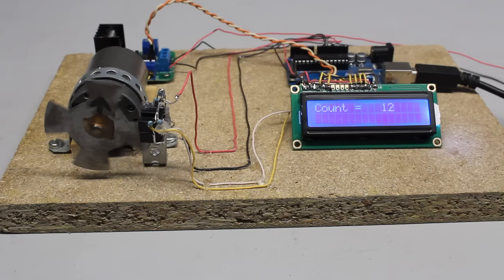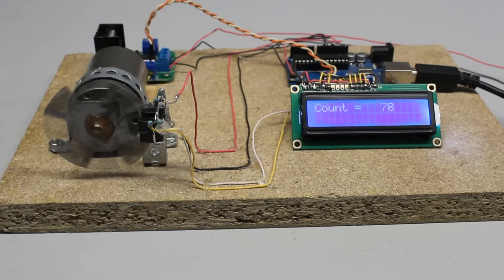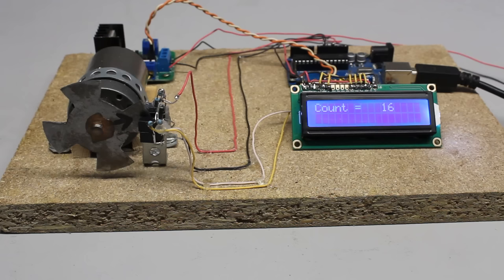By software, the motor can be turned on until the sensor disc has been rotating for one step. If the motor starts spinning continuously, the polarity might be wrong. After swapping the terminals at the output of the H-bridge, we get what we expected from our control loop — the motor spins stepwise. As you can see, the rotation is not divided into equal steps, caused by the fact that teeth and gaps of the sensor disc are larger than the distance between the two phototransistors. After 16 steps, the motor has done a 360 degree turn.